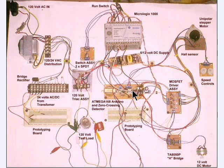Your most basic Arduino chip was programmed simultaneously to control a stepper motor, including speed control, and count how far it actually went. It could go forward and reverse and operate a motor control circuit. Off the picture down here is a model airplane servo, and over here is an AC control circuit that can handle up to 20 amps of power. And it could very precisely regulate the power output. In this demo, we used a 40-watt light bulb, but I have used electric motors and other devices. All of this programmed at once in a little 28-pin chip. That can do a lot.